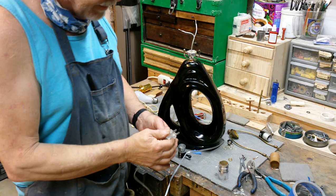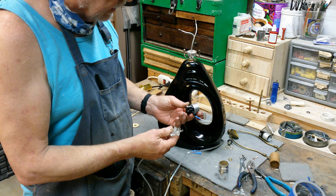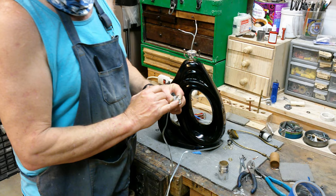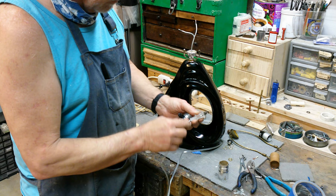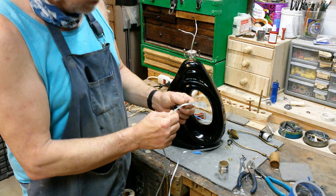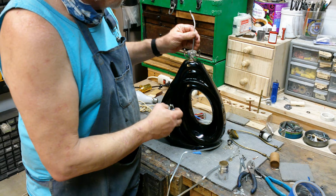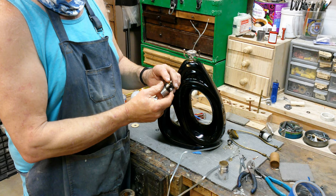Now we've come to the important part of rewiring the lamp — the part where you put it back together without getting somebody hurt. The lamp and the socket in modern North American lighting is a system, and it's a system which makes it easy to put together, and once it's put together, it's safe to use. The first part of that is this wide prong — this is called a polarized plug. If you look at the outlet on the wall, you'll see one side is wide, one side is narrow, so this will only go in one way. The wire attached to that wide prong on the lamp cord has ridges you can feel with your finger; the other side is smooth. The ridged one, which goes to the wide prong, goes to the silver screw. The smooth one goes to the brass screw.